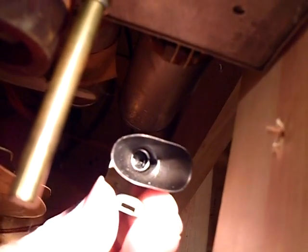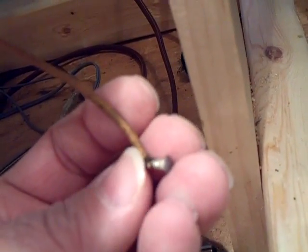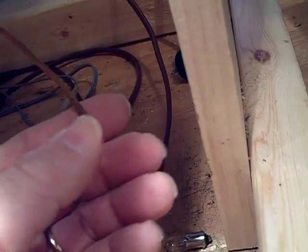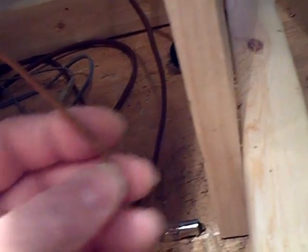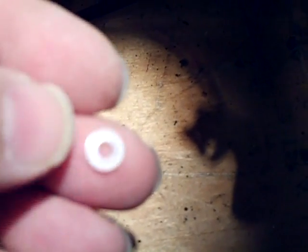You see the stud's too far down because it slipped past the electrical tape. So this one here, I took all the crud off again, all the electrical tape. And basically, you can see his procedure, but what you do is you unsolder the rivet, and you slip on some heat shrink. Then you have the spring. And you have these round donut nylon washers that you get.